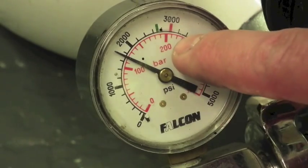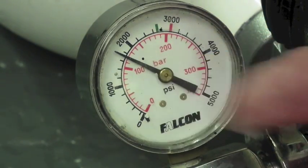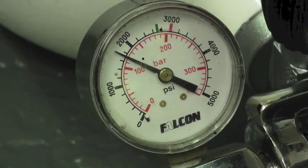If you work out how many bar of air you should be using per shot, and then count the number of shots and watch the needle fall and keep a record of this, this will give you some idea of if the gun is actually firing two or three times, but you're only actually hearing one bang. To overcome this, you would normally increase the outlet valve spring pressure and then subsequently increase the hammer spring pressure as well. And then if you continue to keep a record of how many bar of air you use per shot by adjusting the spring tensions, you'll then be able to get the best out of your rifle.